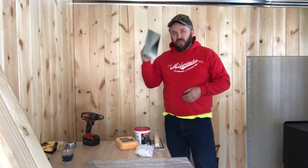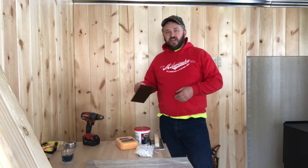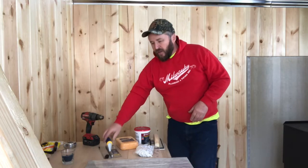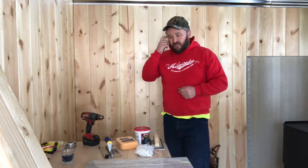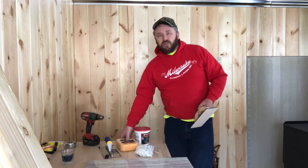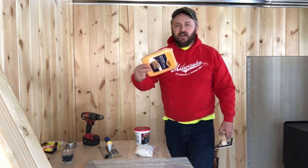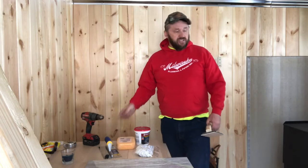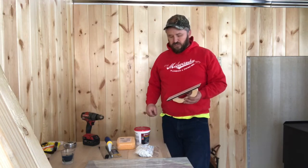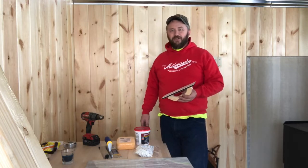And so it's essential to have the right trowel for whatever thin set you're using and for whatever size tile you're using. I'm going to be using 1 by 2 foot tiles, so that's what the manufacturer recommends. Always the most important thing that you can have on the job is a good sponge. And obviously I got a bucket of water off camera. That sponge is going to be essential throughout the whole job. The tile men all agreed on one thing, and they said a sponge is your most important tool.